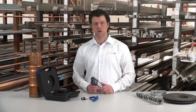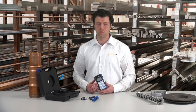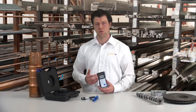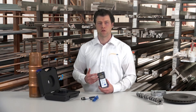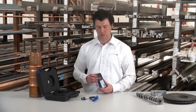Now let's look at the technical data of the PC 900. The measuring area is between 200 and 900 hardness Leeb. This hardness can be converted into other hardness scales such as Rockwell A, Rockwell B, Rockwell C, Brinell, and Vickers. These hardness scales can cover different hardness types, meaning the measuring device can measure different materials such as steel, stainless steel, mouldings, and different soft metals such as copper, brass, bronze, and aluminium. These materials must be chosen before the measurement is done, along with the correct hardness scale, so that the measuring device is set properly for the right measurement.